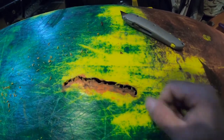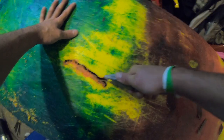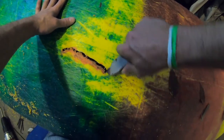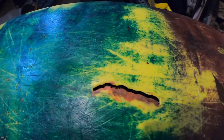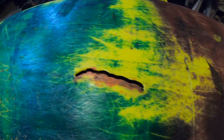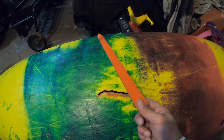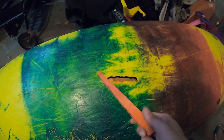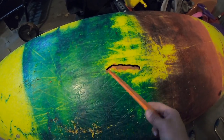We're going to work on that — just put this in a different position and run your exacto knife down the edge a little bit and just round that edge off. That has cleaned up that crack a whole lot more. I know you're thinking, oh my god that thing's huge, what is he going to do to fix this? What you want to do is take your donor boat and cut strips of plastic. Our style, if you were to compare it to regular welding, it would be like stick welding today.